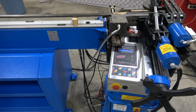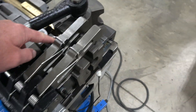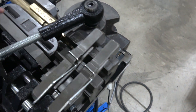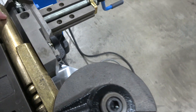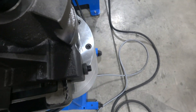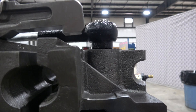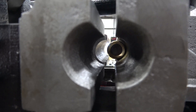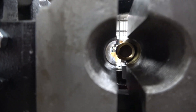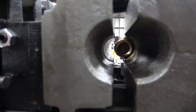Now we'll come back and take a look at how the tooling looks. I've got the clamp die cylinder, clamp die, clamp fingers, pressure die, pressure die cylinder, pressure die lock, mandrel, and the spheres on the mandrel. Then there's your center former up here — you can see the top of the center former and you can also see down the line in there. You can get a good look at that wiper — you can see the wiper lines up to a tangent point, it flows even with the pressure die, and the former is lined up with the radius of the former. Very smooth — a good continuous surface for the tube inside as you bend.